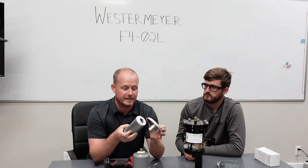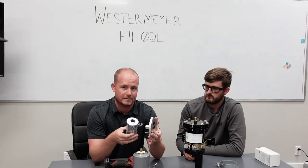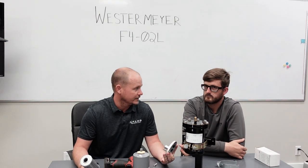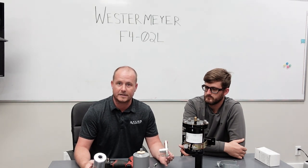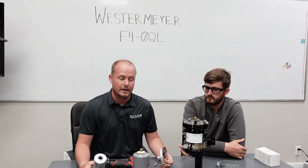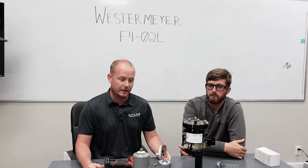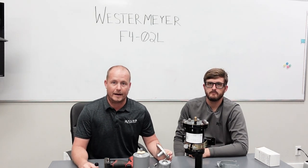Based on this assessment, most of the differences appear to be advantages with the Westermeyer oil filter. But most importantly, if you're working on systems with oil filtration, you need to be actively managing the oil system and changing your filters regularly. Lubrication is absolutely critical — contaminated oil leads to significant compressor problems that cascade through the entire system, since in managed oil systems one oil supply feeds multiple compressors. Having an oil filter that's easy to maintain and properly installed is absolutely huge.